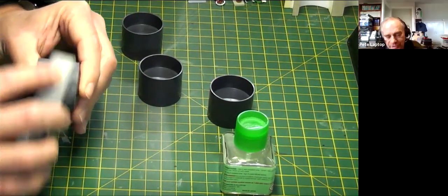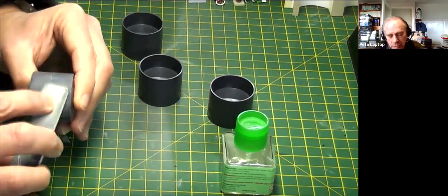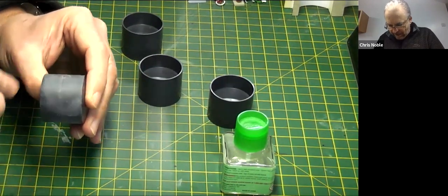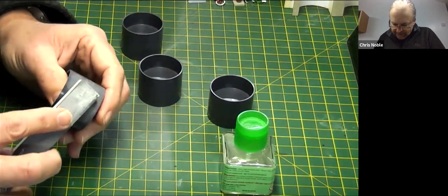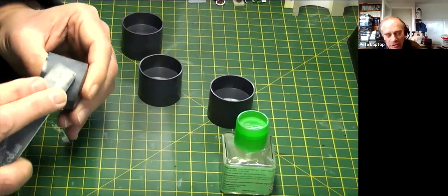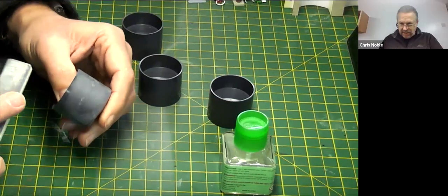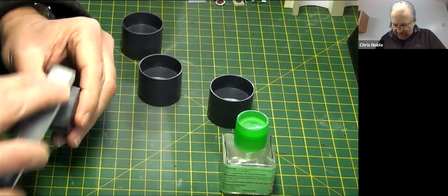I mean, I can see all the tiny, tiny little scratch marks from the abrasive, but that doesn't matter, does it? No. But I've got a little line there and I can feel that. And where I've demonstrated what you were talking about earlier by having a finger mark on it, what do I do about that? Just keep sanding. Leave it to dry. Yeah. And wait till it's really dry and then sand it out. Okay.